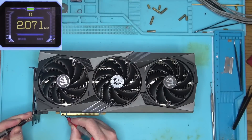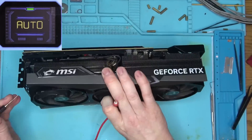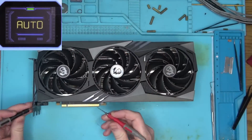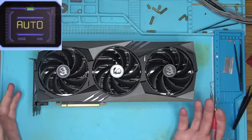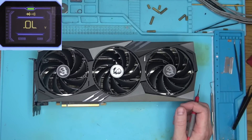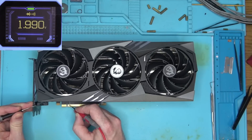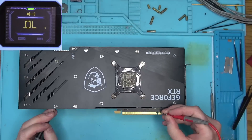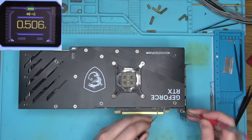In auto mode, checking resistances and finding no short — we get a pass. However, when measuring data lines, which have to be performed in diode mode, the meter measures the resistance instead. This is very much expected because we're not measuring the diode but the semiconductor circuit, so there's nothing wrong here.